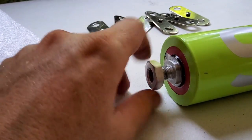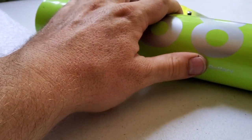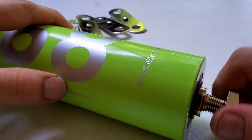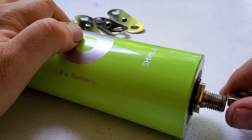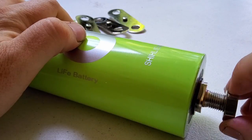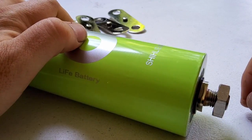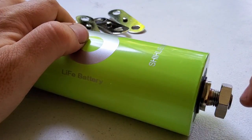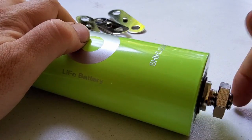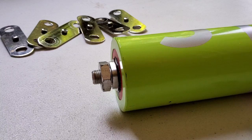When I got these cells, the terminals were a little nasty — they had some debris in them. I don't know if it had some kind of paste or something. When I tried to screw the nuts on initially, they were binding up, and you don't want that to occur. If you feel resistance when tightening these down, that means you're about to strip them or cross-thread them, and when that occurs, the cell is pretty much screwed.